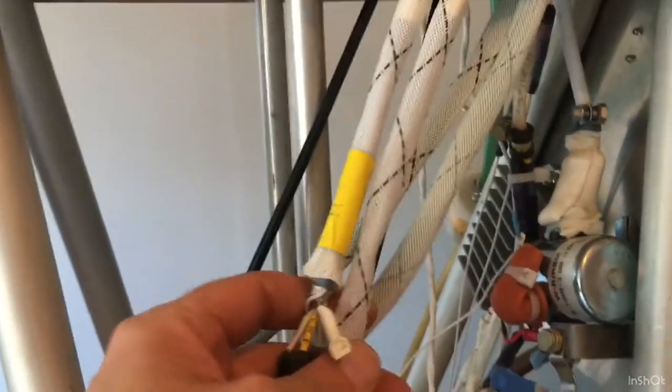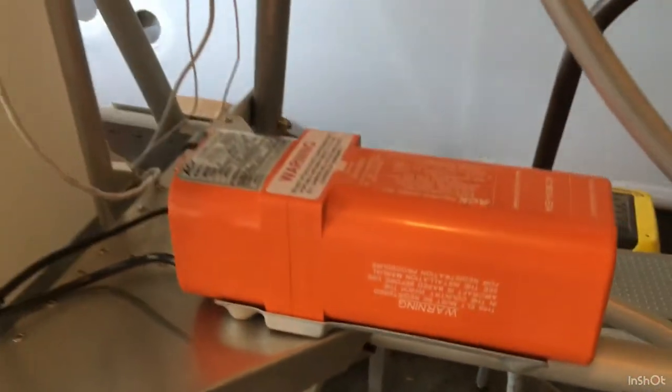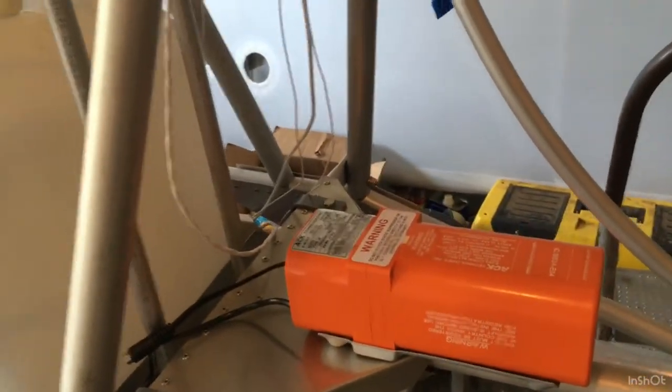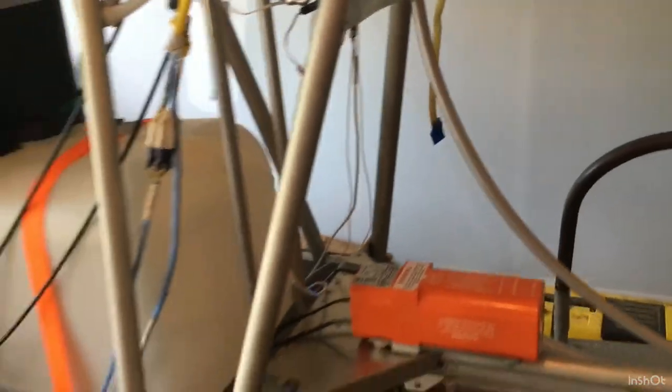And then I ran these down into the tube down there. I did it on the opposite side, because you want to keep it away from the ignition. There's my ACK ELT. I'm going to mount it right there. I'm trying to figure out where the antenna placement should be. I thought about mounting it inside the little compartment back here, but having the ELT antenna so close to the gas tank is probably not a good idea. Anytime you have communications around gas tanks, it's not a good idea, especially in airplanes.